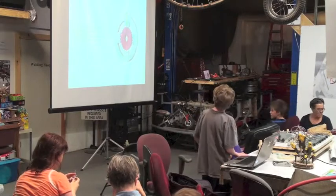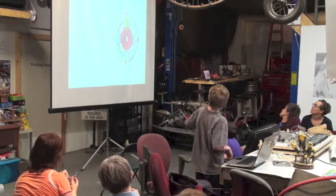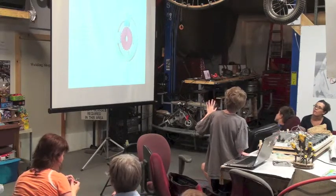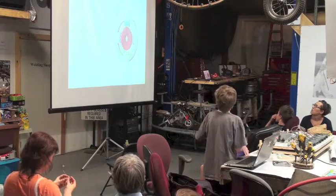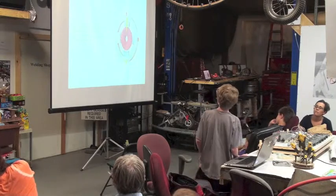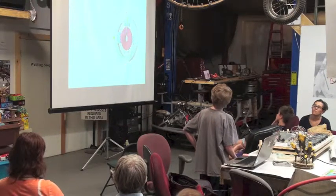Anyway, the way it works is there are teeth internally, and the one that's being passed around is larger, with a tall shaft, and it looks a lot like that picture there, except there are more wires. The coils have little teeth on them, and the gear internally has teeth, and the teeth on the gear align with the teeth on the magnet. So it will always align those, and then you go around and around that step. Each time it steps normally, it'll step 3.6 degrees. And then, obviously, it'll step 100 times to a full rotation.